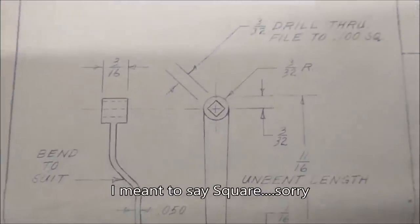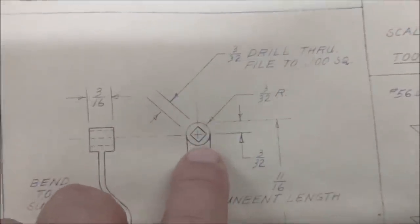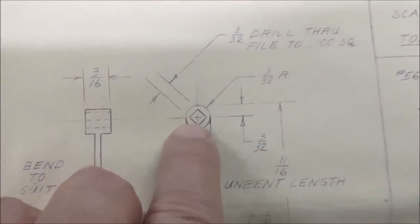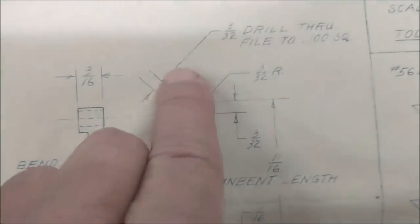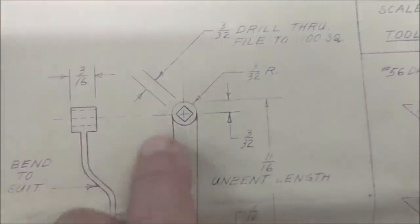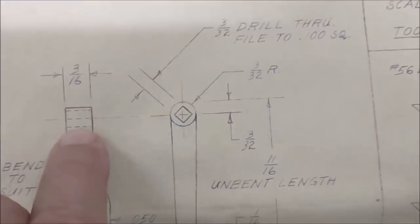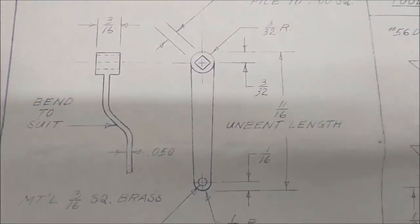Now on the rotary table, one good way of making sure you don't have an index mark on the outside of your part is to make the inside radius a little bit bigger than the outside. That way you can swing a larger diameter, and when you do the profile and pivot around that corner and come back, it cleans up nicely and you have no witness lines on the outside in this area. Okay, let's get over to the vise, knock the blanks out.